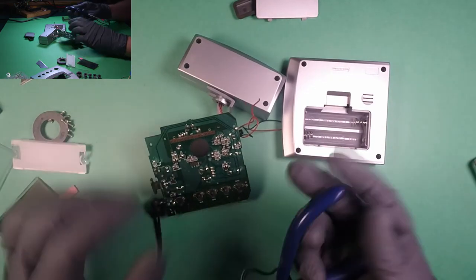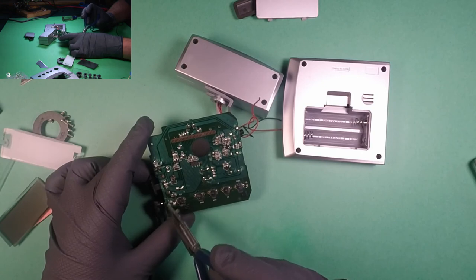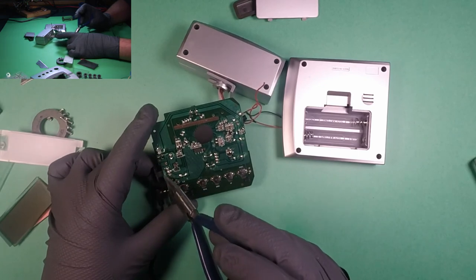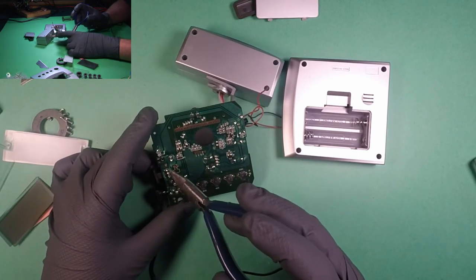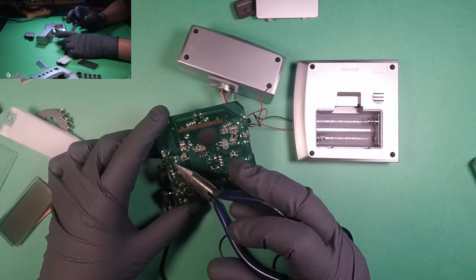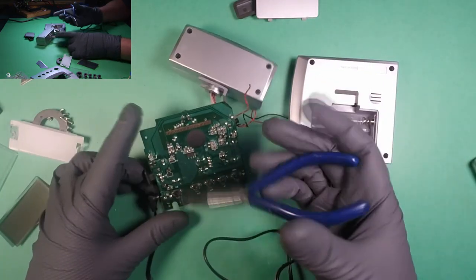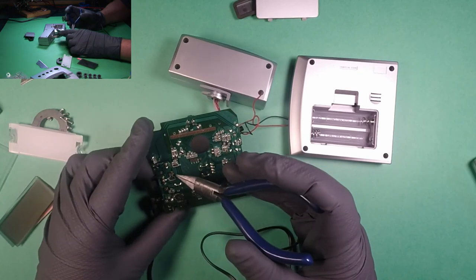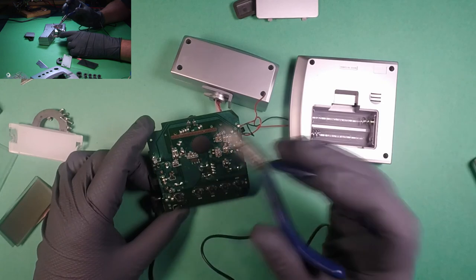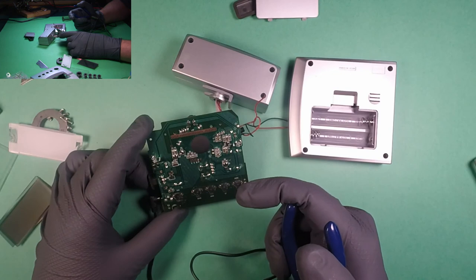this external power source, only powers the LED for the projector. If you look at the positive comes around, this is ground. And this is the positive. This comes around to here, which is a switch. And when it's in the upper position, it allows current to flow to here, which is the wire going to the LED in the projector. When it's off, power comes through here and it gets its power from the same source as these. So that's actually really interesting and, well, stupid.